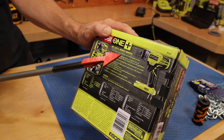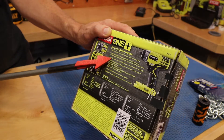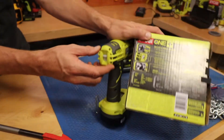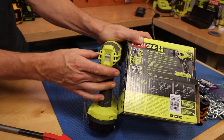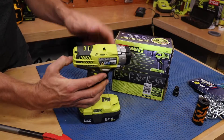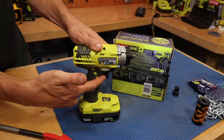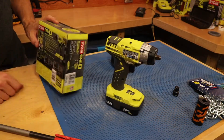For automotive use, you're going to be happy it has the hog ring. This produces up to 150 foot-pounds of torque and up to 3,400 impacts per minute. It also has a three-speed selector — one, two, or three — for a variety of applications, plus a variable speed trigger as well. Very simple to change.